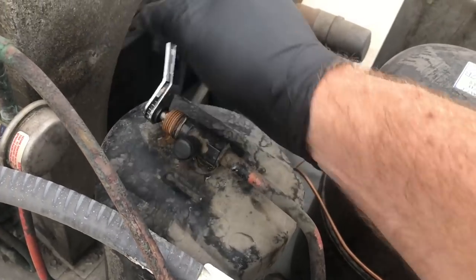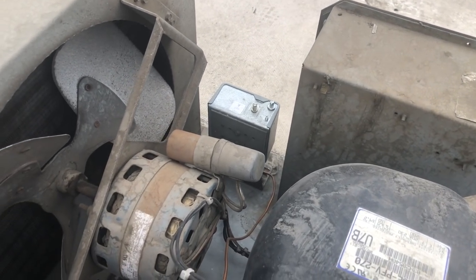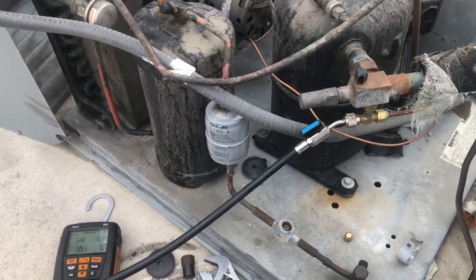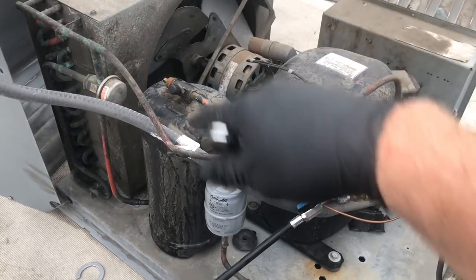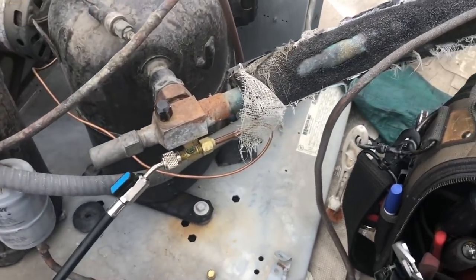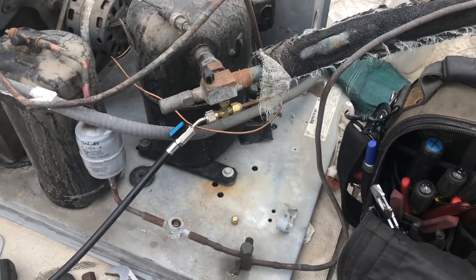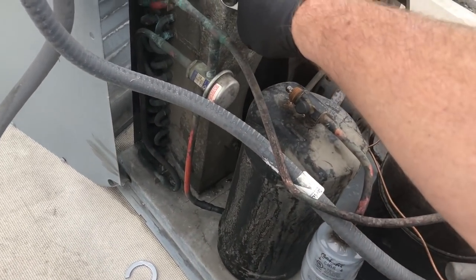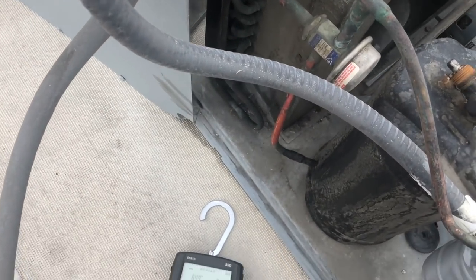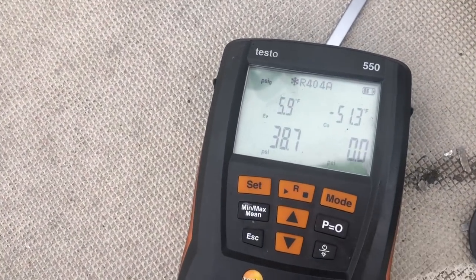I'm going to go ahead and close that down, turn the unit on, and then I'll bypass that suction pressure switch over there with my screwdriver when we get to the end, and we'll pump the unit down so we can make that repair. So we'll pump all the gas back, and then coming out from here, going back around, down to the unit, coming back up to here, we can make our repair. All the refrigerant will be in the condenser and the receiver. What's left? And the static pressure was like at 133. I want to see where the cutout is anyways on that pressure switch. It's a good time to see where your cutout's at.